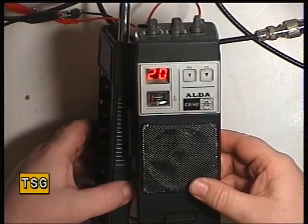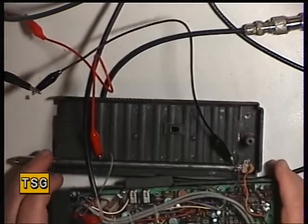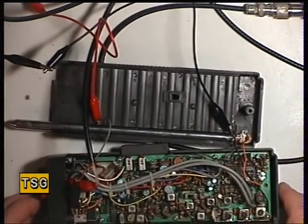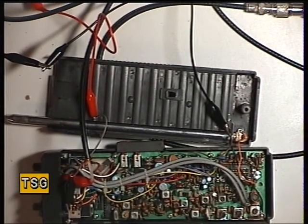Just to prove to you we have that switched on, it's connected to the power supply at 12 volts. These are not 13.8, they are 12. It's very important that it's one of these arrangements where you've got the 10 AA batteries if they're rechargeable, the logic being 10 times 1.2 volts is 12, or 8 1.5 volt throwaway batteries, 8 times 1.5 volts equals 12, in which case you use two dummy batteries, which, if you don't have the originals that came with the set 30 years ago, are readily available.